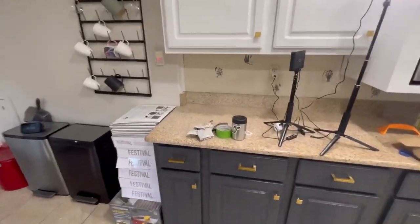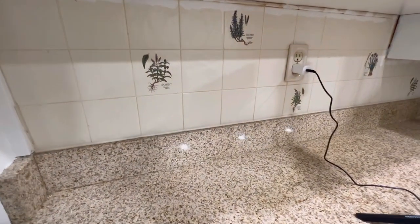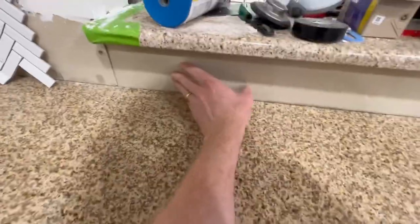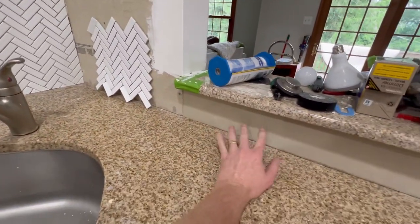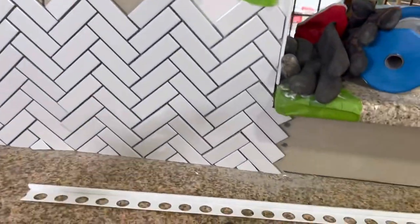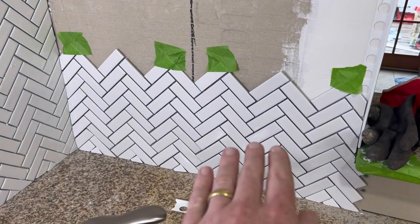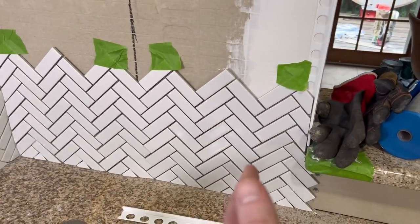What I'm doing now is tiling this wall right here. We're clearing stuff out on this side and I'm just going to be tiling right over this tile. I'm going to really clean it up so my tile adheres well. I cut a little piece of hardy backer right here that I'm going to throw in this corner. I have my design laid out right here — I had to make that little notch cut down there, then I continue to the end over there. I realized I can just use two tiles on this space, nip those edges on the saw, and I'm happy with that.